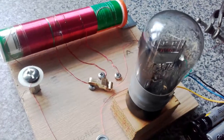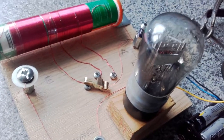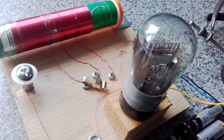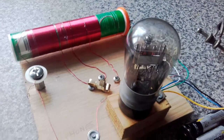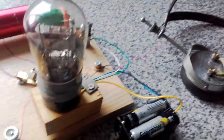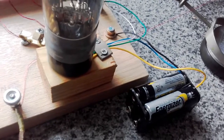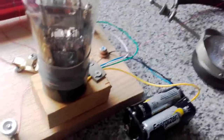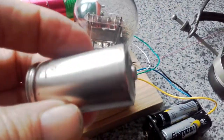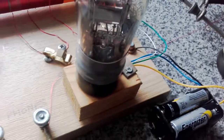It's quite surprising that from a few readily available parts that could be obtained in a prisoner of war camp, they would have been able to build a very effective radio receiver. It would have collected radio frequencies on the medium wave band. As you can see, it would work down to one volt, so you don't even need any fancy energizer batteries — one of these old torch batteries would have done. I had that one in circuit earlier and it worked very, very well considering how old it was.